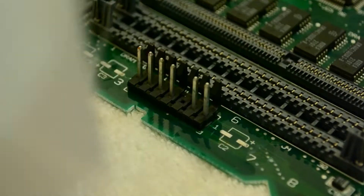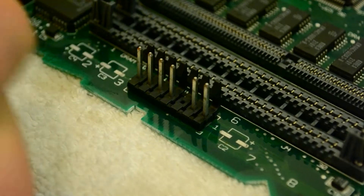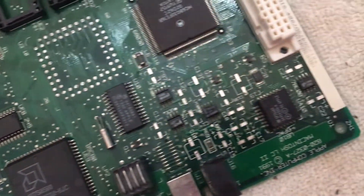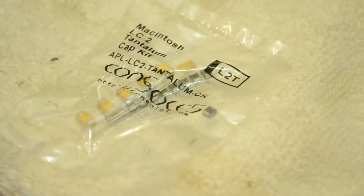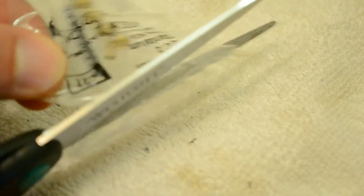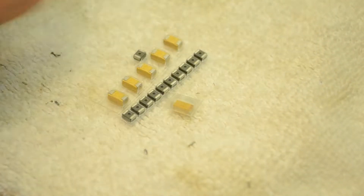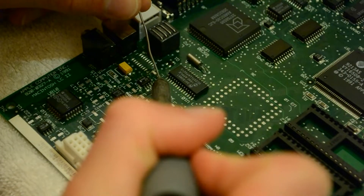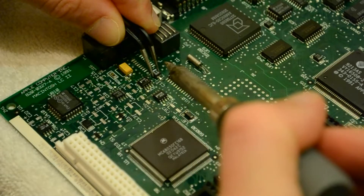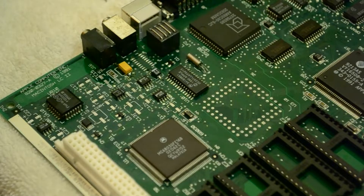Usually the leads stick to the soldering braid, but if they don't, I break out the tweezers to fully remove them from the board. Apart from removing the old capacitor leads, I also use the soldering braid to remove any old solder as well. Once all the old leads are gone and the pads are clear, I use some alcohol and a Q-tip to clean up any remaining flux. These pads are looking a lot better and they're ready for their new capacitors — tantalum capacitors I bought off console5.com. They make really good cap kits for these Macintosh computers.